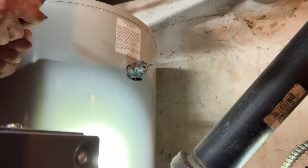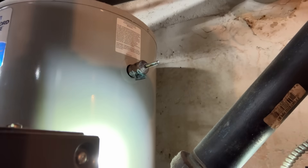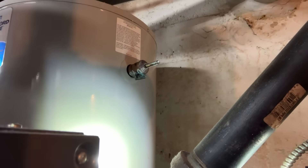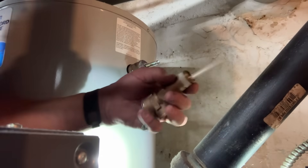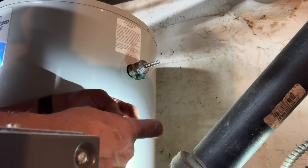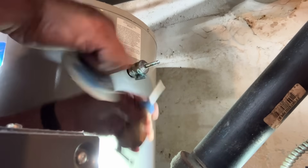While it's pumping down, I'm going to use this time to take out the temperature and pressure valve. You can use a pipe wrench - wow, that was just hand tight! No real effort required at all. I've got a new one ready. I'm going to throw a little Teflon tape on the end of it, even though it comes with a little PTFE tape on it already. Watch, ladies and gentlemen, how I do this - there's really only one correct way of wrapping Teflon tape around threads. See how I'm doing this? Six times around.